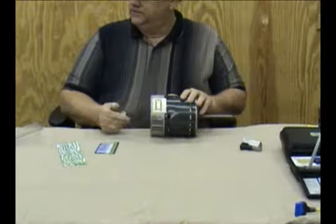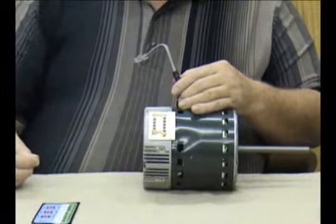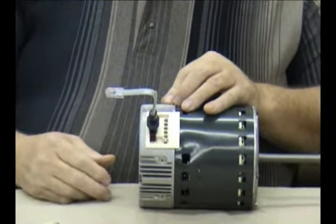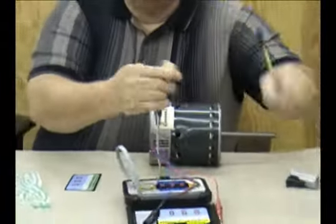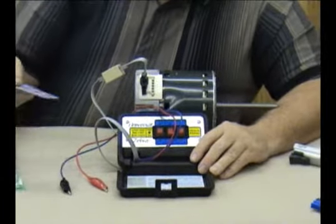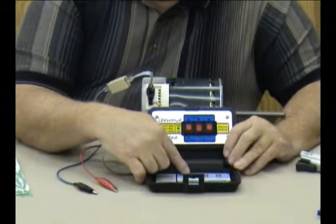Normally this would be in the unit's cabinet that you'd be doing this, but we're just showing you this for clarification. You would disconnect the signal harness, which is a 4-pin connector. Remember, the 5-pin connector is for power on these. You'd plug adapter B into there, make sure that your universal zebra then has adapter B plugged into it. You would take the magnetic overlay card that comes with adapter B and place it in here, and it's going to tell you that there's only one speed to test on — it just says test.